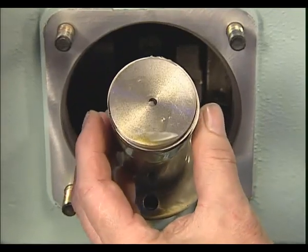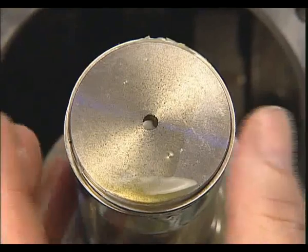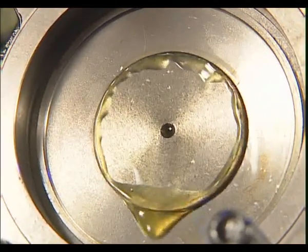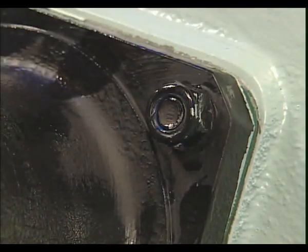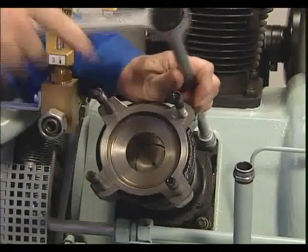Before the installation of the cylinder, the piston ring should be centered using a small amount of bearing grease. When installation is carried out properly, it should be easy to crank over the compressor a complete revolution by hand. Only after this functional test can the base nuts be finally tightened and the surplus oil removed.